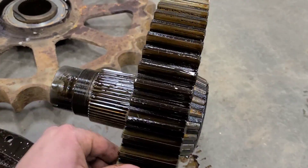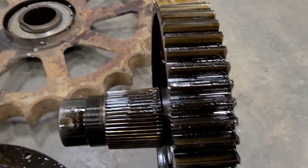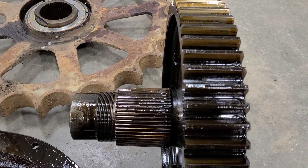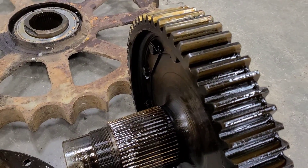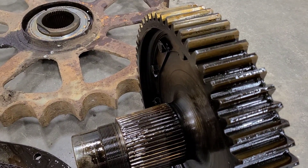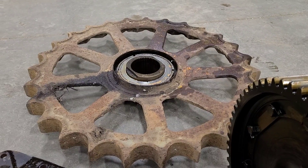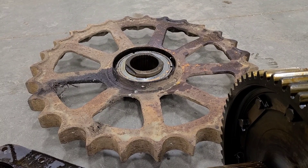As far as wear on the teeth, they do have a little bit of wear going on. I don't know if it would be enough to justify replacing these — you've got to remember this thing's not going to run 12-hour shifts five days a week anymore. It's going to be more or less a hobby machine. I think they'll be just fine. If anything, we could possibly look at switching side to side, as long as we take the mating pinion gear with the bull gear and switch them side to side. We'll look into that when we go back in to assembly. And then we have the sprocket over there — so everything is apart. I'm going to go ahead and start cleaning some of this up, and I've got a second one to drag in.